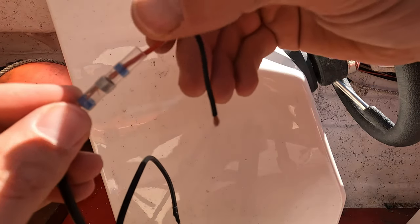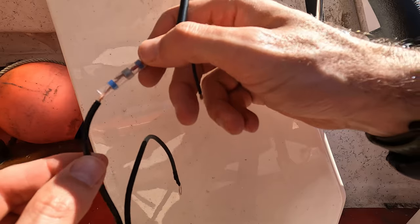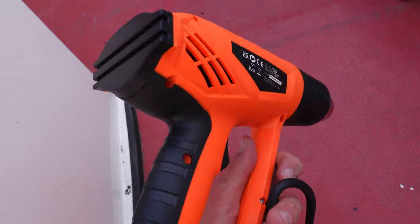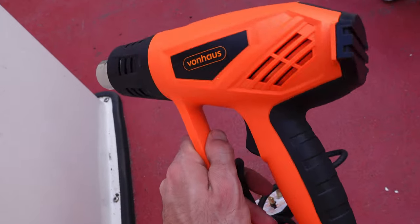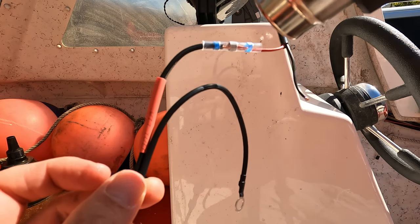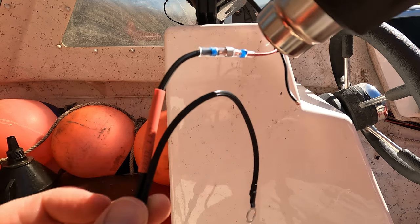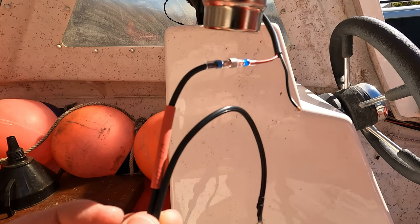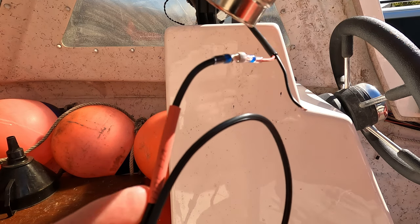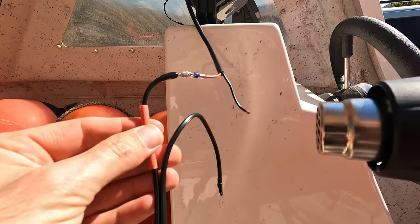I melt this bit in the middle and it will bind these two together. But don't make the mistake I nearly made right here - don't forget to put the heat shrink on beforehand. You will need a heat gun for this - just the cheapest one I could find on Amazon does the job. Heat sleeves on - positive to positive, make sure you don't mess that up. I'm going to do the outer heat shrink first, then let the solder cool down before doing the heat shrink or it'll just get stuck on it.